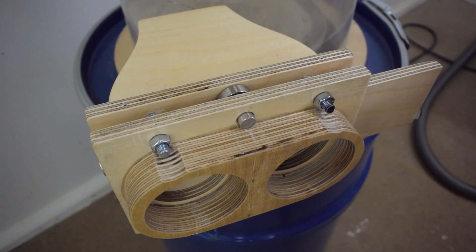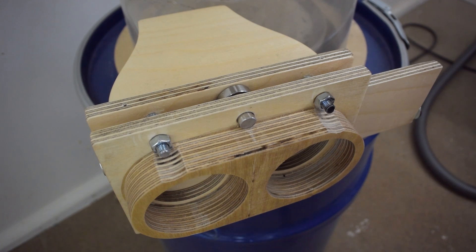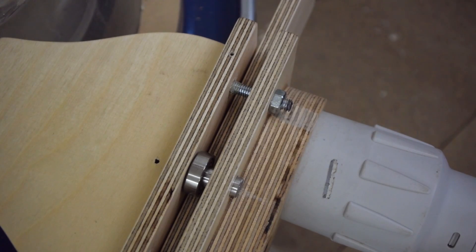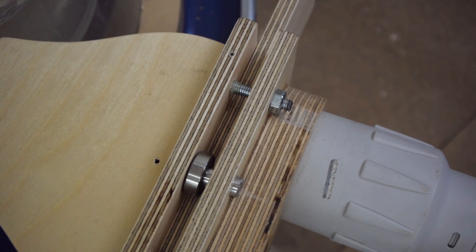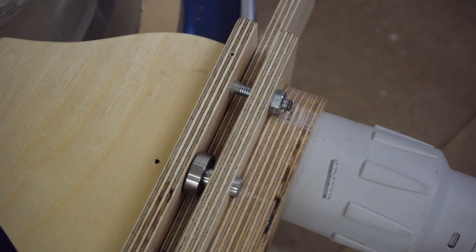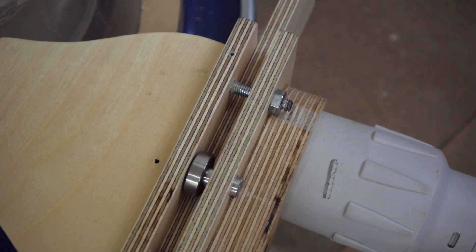Which means that when the system is not pressurized the slider should be able to move with very little friction, and that in turn means that I could use a small and cheap motor for automating this thing. But that didn't work out so well because the pressure times this relatively small cross section does not exert enough force to reliably squeeze these plates together. As you can see it barely works when only the smaller hoses attach, which is much lighter and has a lot more resistance to the airflow. There are a couple of things that I could change about the overall shape of the parts to maybe make it work, but I really doubt that this would be practical, at least not for this setup.